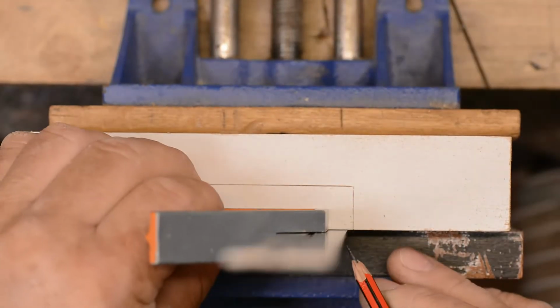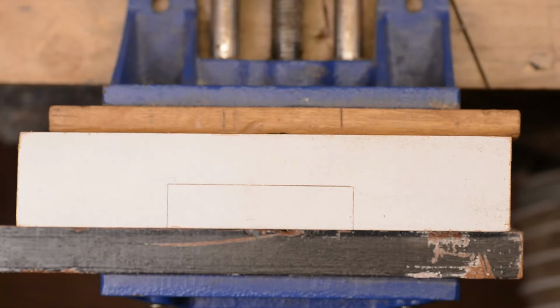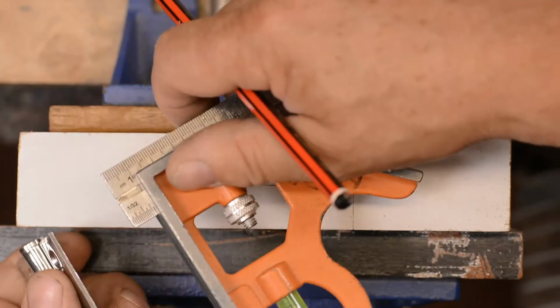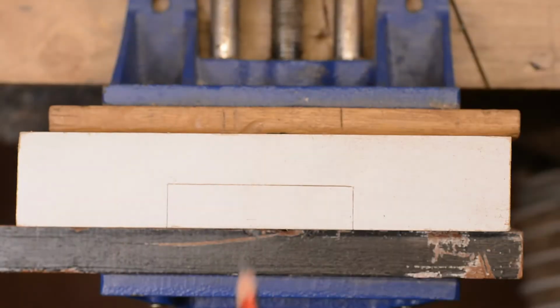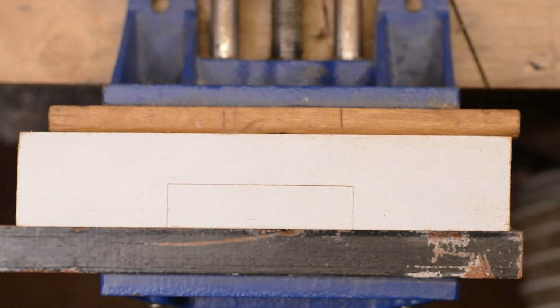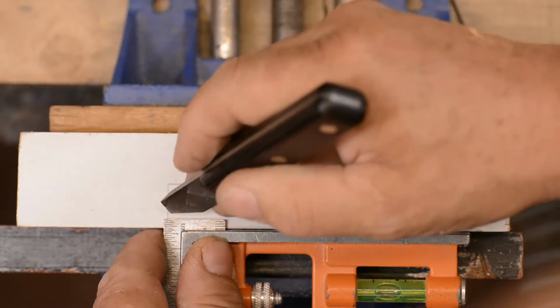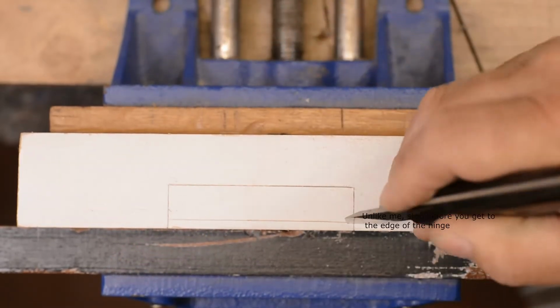Mark down the front's going to be your edge of the door. And that's your guide. And then we're going to come in. You can either use a marking gauge or combination square, make that flush. Then just mark it on the edge for your depth of your hinge. Right, that's the normal bit. Just come in 5 to 7 mil. Get your mark. Come on in.